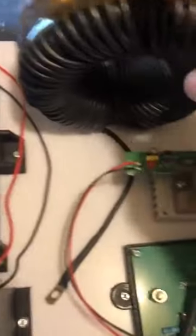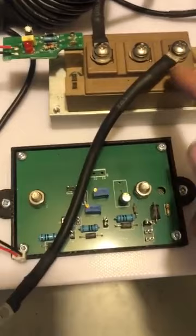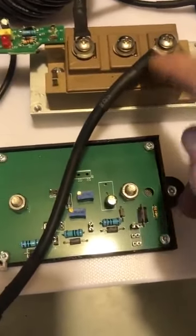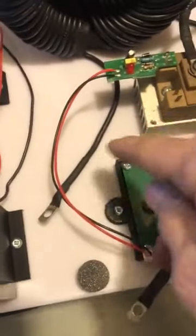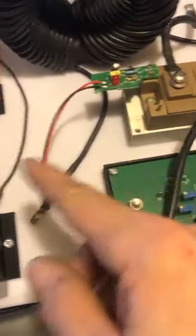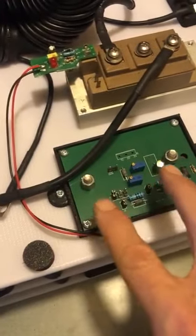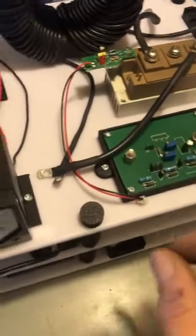Here's the entire setup, just like I explained. I'll go on and wire him, but the post is just about to run today and my big IGBTs — 1200 volt, 600 amp — might be in. If they're in, I might look at putting one of them in this place. Not that we need 1200 volts, but we definitely won't blow it for over voltage because there's only a potential difference of up to 600 volts here on this dumper that we are allowing. It's like a buck converter, but a very, very efficient one.